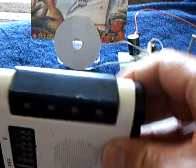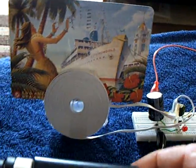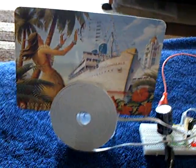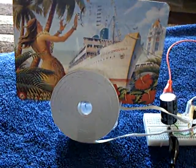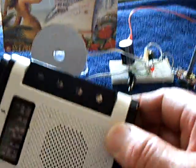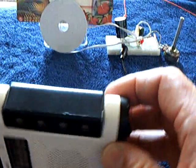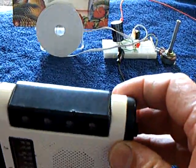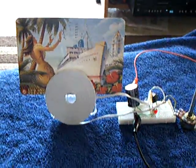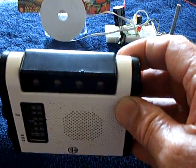So what you could do is if you sailed toward Hawaii, you could move your radio back and forth — the antenna — and home right in on Hawaii. We started getting Hawaii music about 300 miles out. And then coming home, same thing — we got AM stations way out there and used this method. It was a radio direction finder that, by turning the antenna different directions, you could find a null, and the null gave you a direction to the radio station transmitter. Now if you had two stations, of course, you could get a fix, and that was even more valuable.